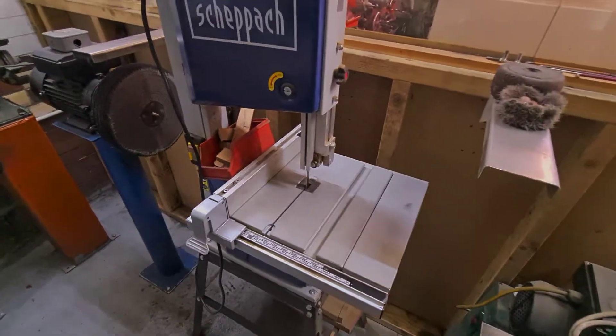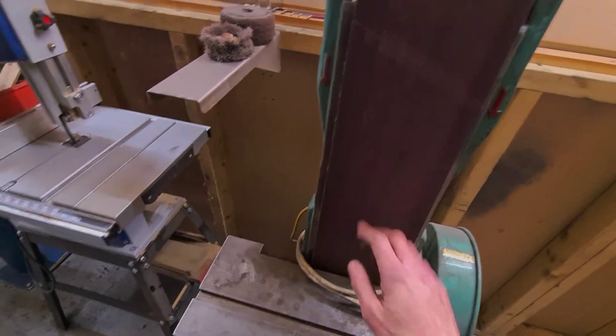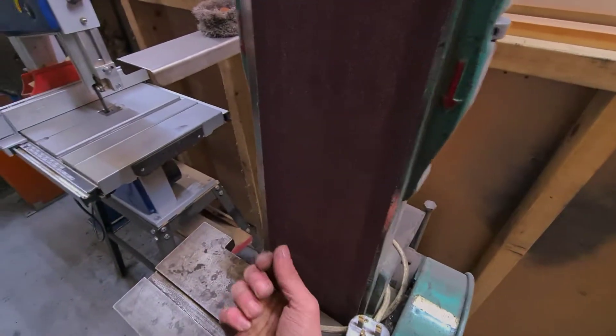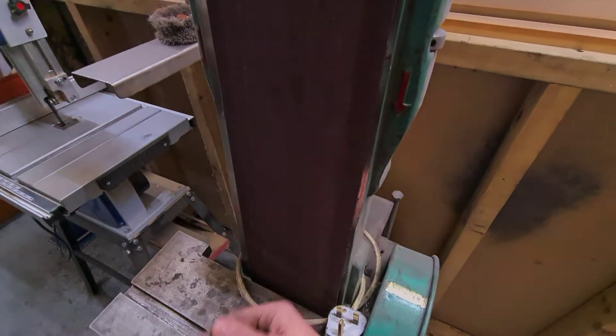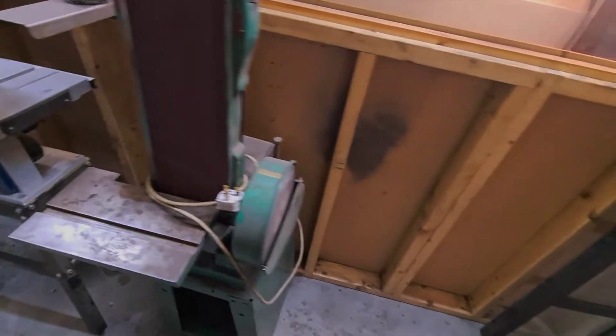Woodworking bandsaw for cutting the wedges, which we make out of oak. We've got another linishing machine, which we use for sharpening the points on the scribes and center punches. Always remember when you sharpen a center punch to try and keep the grain running down to the point, as though you're sharpening a tungsten for your TIG welder, if you do any welding.